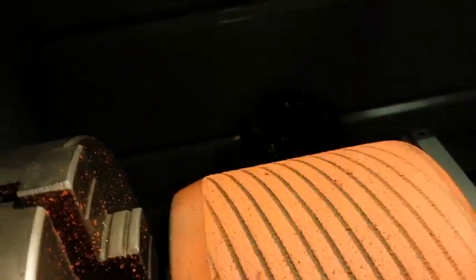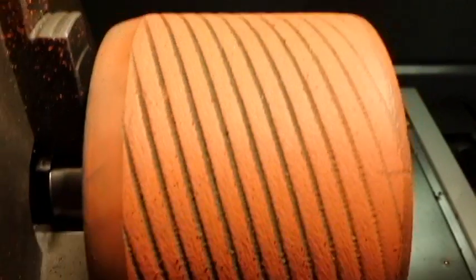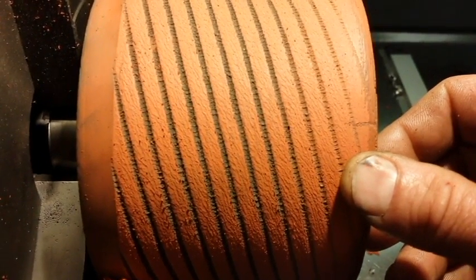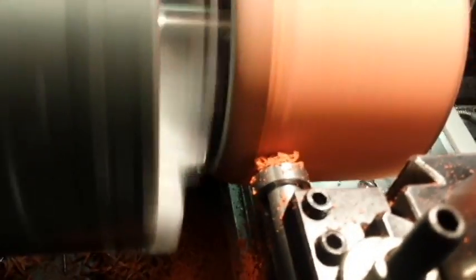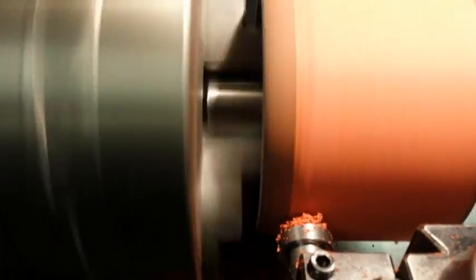Well, since it's a rough cut, I'm going to remove the rubber. It cuts so well. It's a little rougher since my feed was pretty quick. But when I did a 2 thou per revolution advance, it was a lot nicer. You can actually do very fine cuts with this. I'm doing a fine cut right now — it's basically just powdered rubber, maybe five thou. I'm going to finish it in a second, and then I can show you the finish. We saw the rough cut, and we'll see the fine cut — see what type of finish we get.